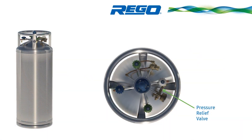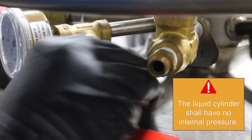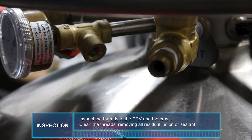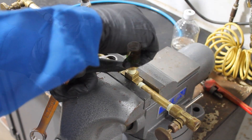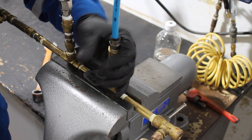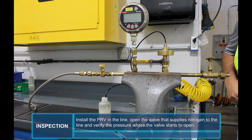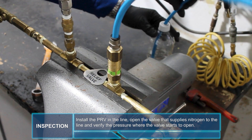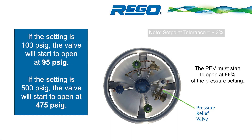And now for the pressure relief valve. First is disassembly. The liquid cylinder must be empty and without pressure. Inspect the threads of the PRV and the cross installed on the liquid cylinder. Clean the threads of the cross of the liquid cylinder, removing all residual Teflon or sealant. Connect a nitrogen line from a cylinder or any other source. Use a calibrated pressure gauge and vent valve. Set the line regulator at the setting of the PRV. Install the PRV in the line, open the valve that supplies nitrogen to the line, and verify the pressure where the valve starts to open.